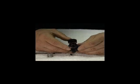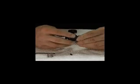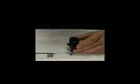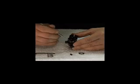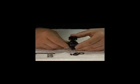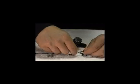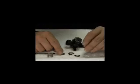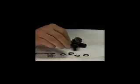However, pressure can be adjusted by removing some shims. Shims can be removed by simply turning the reg upside down and shaking them out. If they do not shake out, remove them with a pick, being careful not to damage the body. There are two types of shims: a red thick shim and a silver thin shim. The red shims are thicker and will not bend. The thin shims will bend. Be careful so you do not fold them in half.